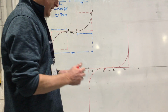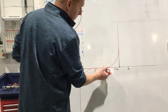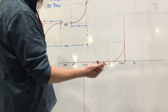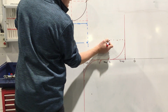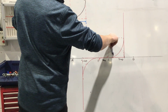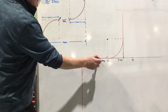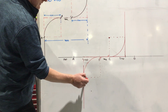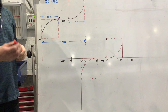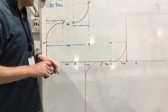If you don't have a radius ready prepared, what you'd have to do is measure up 150 and measure across 150, which are square. Okay, put your compass on that point there. Mark from there to there. Okay, and then turn your compass around, and it will bring you around and show you the curve. Or your dividers. Same thing here, like so. Okay, and then you do that. It'll join the two points. Okay, 150. Is that okay? All right. So we have that marked out.